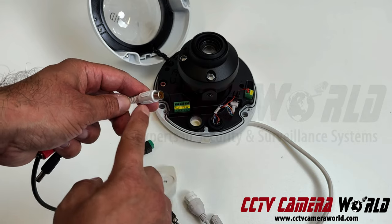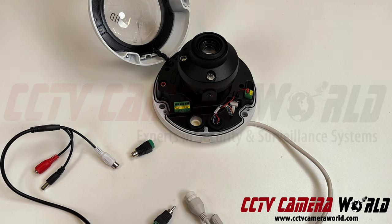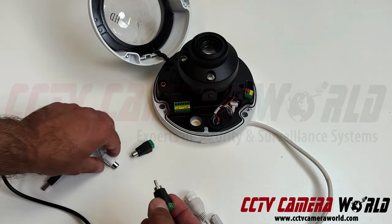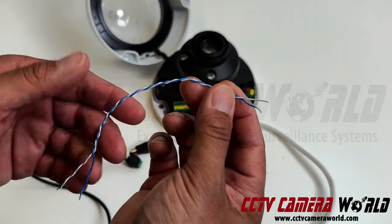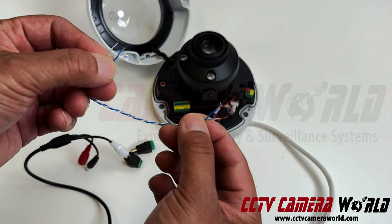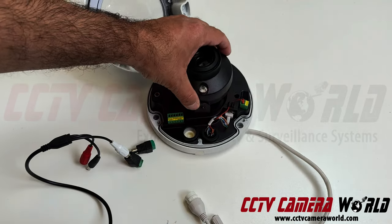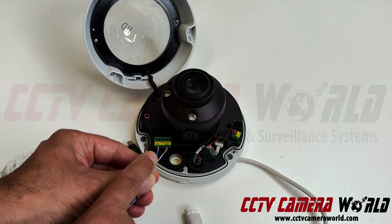Audio goes in here, comes out of this connector, and you have to connect it into the camera. There are two ways to do that. If you just want to run a lead straight out, terminated with the male connection that plugs into the mic, you could use something like a two-lead wire — like CAT5E — with proper precautions for outdoor elements. Make sure you put some electrical tape around anything you splice together. I'm going to use the striped wire for positive and the solid wire for negative.